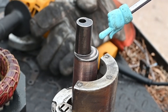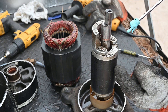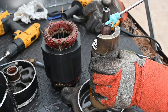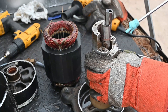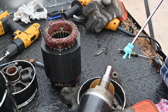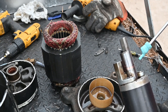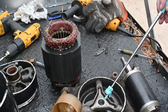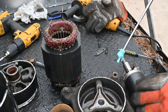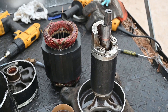There are some grooves here, and that's definitely from refrigerant flood back — at one point they had too much refrigerant, low superheat coming in, maybe a dirty filter, and that liquid refrigerant went to the bottom. As it pumps that liquid refrigerant through the center, the bearing farthest away will have the most damage. There's a little bit of wear, definitely signs of refrigerant flood back. It can also be caused by low oil, but in this case we drained the oil and saw there was plenty in there. At the bottom there are very small signs of wear and a little bit of copper plating, but it looks really good. These are the fingers that pick up the oil as it spins — that centrifugal force drives oil up through the shaft and lubricates all these moving parts. Here's the very bottom bearing — when we get liquid refrigerant in here it goes to the bottom and pushes the oil up, so liquid refrigerant goes through all these moving parts instead of oil. But in this case the compressor is really in good shape. It was still running when it was pulled out, and it's really impressive to see.